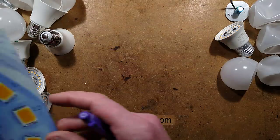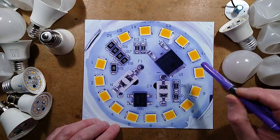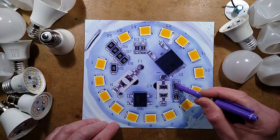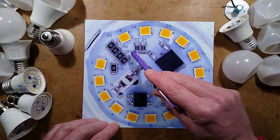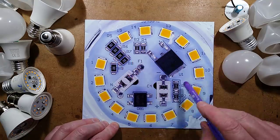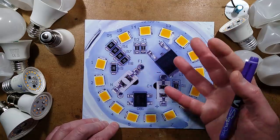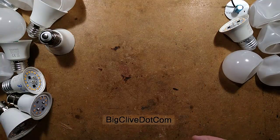Things worthy of note - the Philips did have a slight twist. The Philips has a larger board but the same SM2082EAS arrangement: supply via a 20 ohm resistor through the bridge rectifier. A good improvement: it uses two 510k resistors in series as a discharge resistor, better for voltage rating. It also has five 3000 ohm resistors in parallel in series with the LED string - effectively a 600 ohm resistor - possibly to reduce current spikes. Philips always has interesting twists in their lamps.